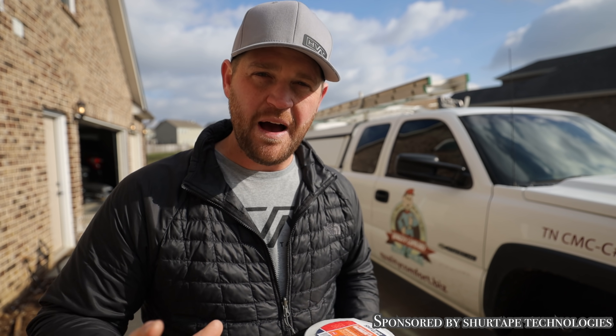What's up guys? Welcome back to the channel. I'm going to be installing some indoor air quality products on a heat pump split system today. I've got quite a few different devices I'm going to be installing. One is going to be a UV light for the indoor coil to keep it nice and clean. Then we're going to be doing an air purifier that goes into the supply plenum. And then we're also going to be installing two 5-inch air filters down on the return side. Let's do some work.